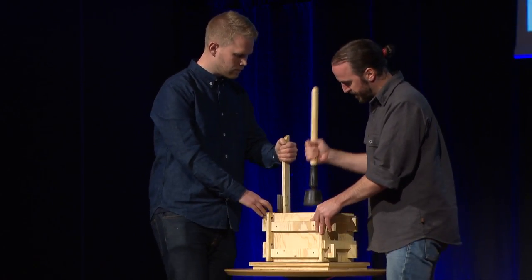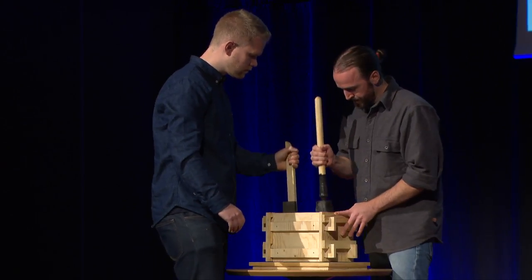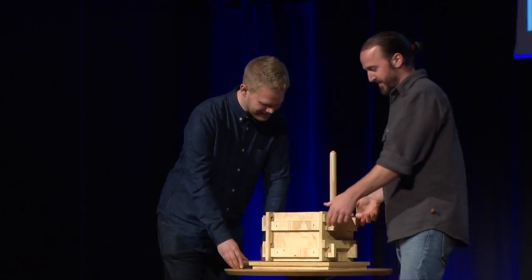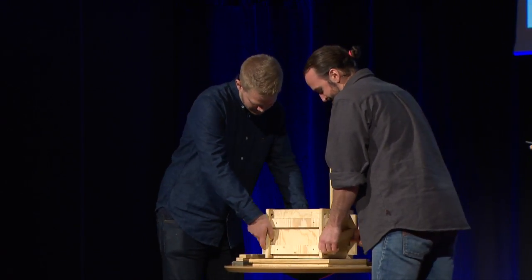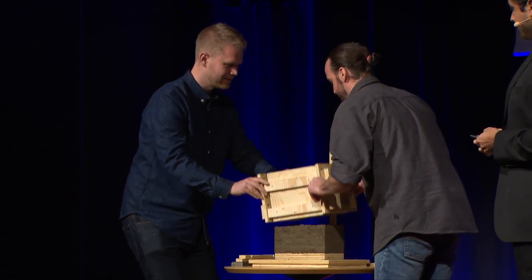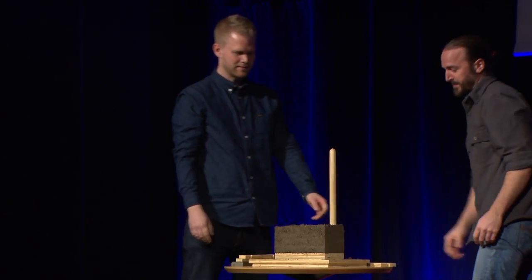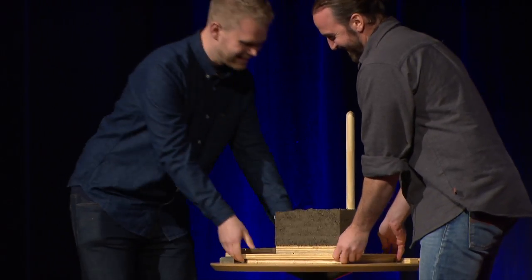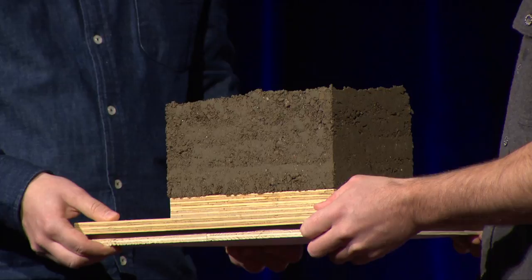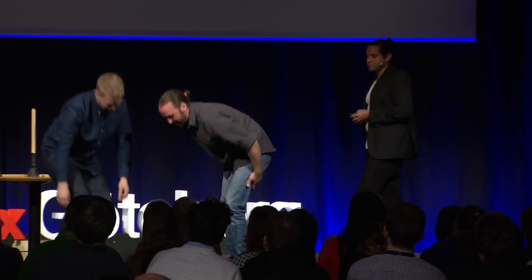We feel that earth is a piece in a bigger puzzle. It doesn't have to be in the scale of a building — you can also do other things, like building fireplaces, candle holders, or even lamps. Seems like the rammed earth demo is finished. The form has been used as a tool to shape the earth — we are going to remove it and show the earth beneath. This is how a fresh rammed earth wall looks: it's a little bit dark in color, but it's strong enough to continue building on top. You don't need the wall to be completely fully cured.